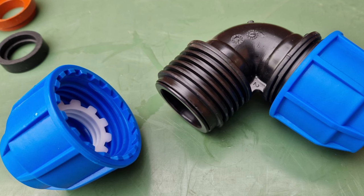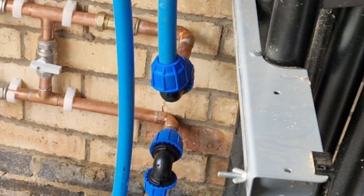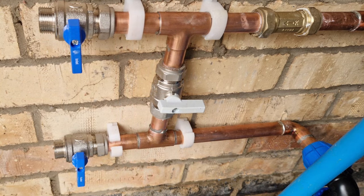And then once those are pushed in and connected up, you can see the bypass fits really nice, and it's really snug fitting. At this stage you can put the water back on and turn off all the controls and just water test it. You always get a little bit of a seep on those 25mm connectors because you don't want to over tighten them, and you can just squeeze them shut.